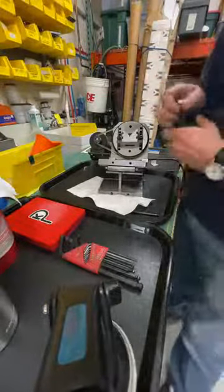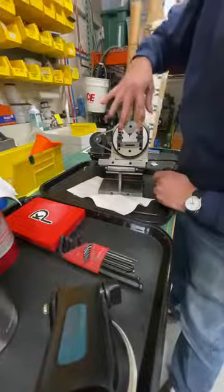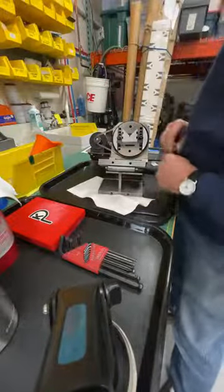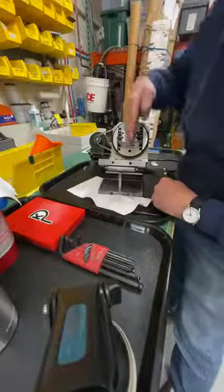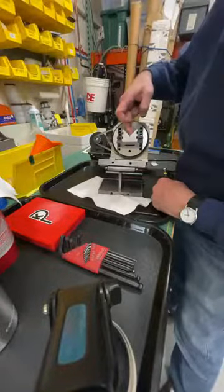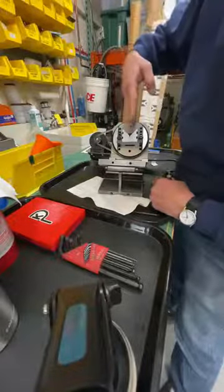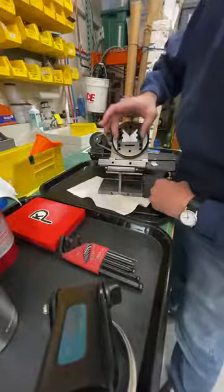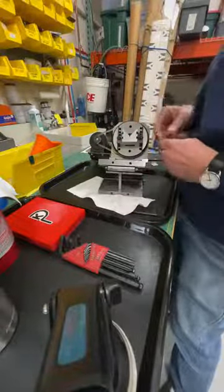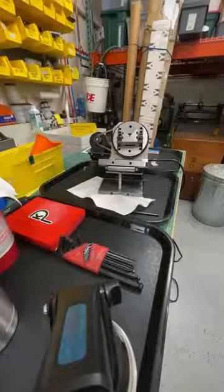Yeah. So this V-block rides up and down in a channel here. And there's multiple threaded holes, and this is where we can offset our part. The V-block puts it on center, left to right, and then we could slide it up and down to center it or offset it. And in our case, we're offsetting it. So that's kind of the ticket.